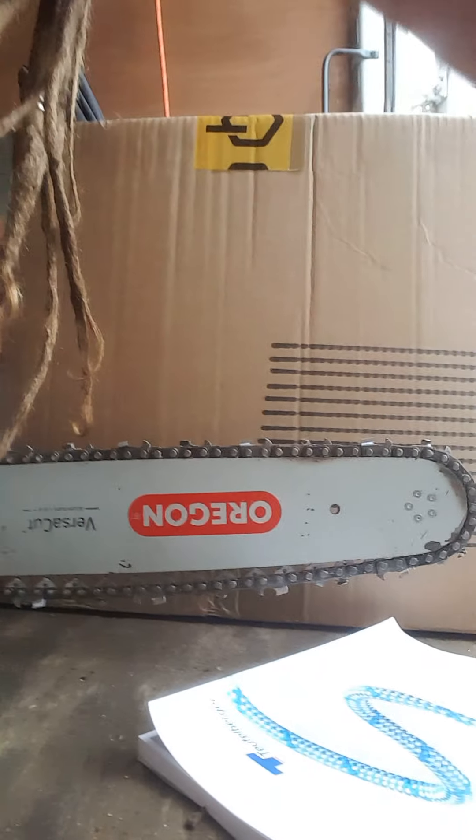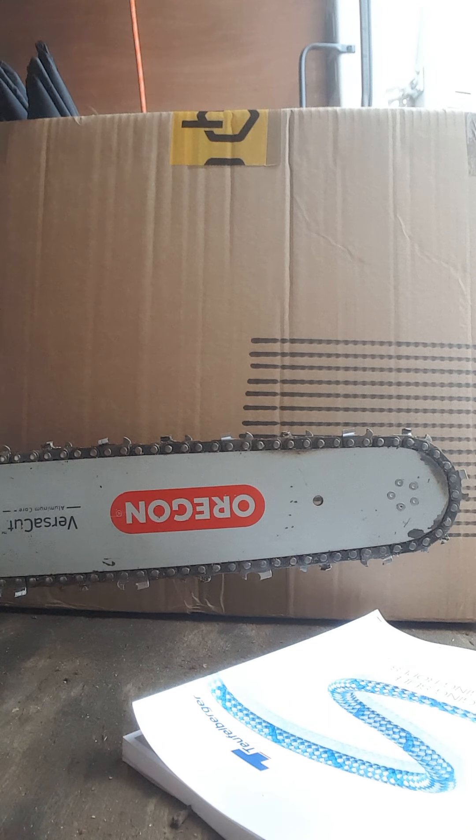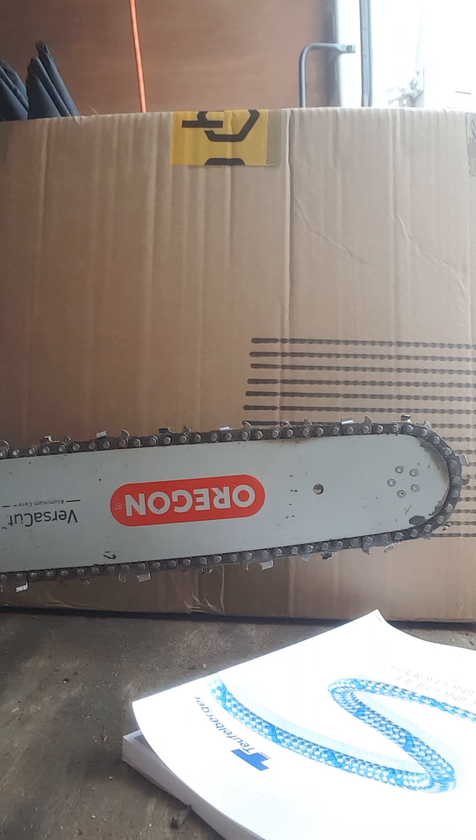All I'm going to do is go back to the chain adjuster and dial clockwise. Did you see the bar rise there? That's correct chain tension.